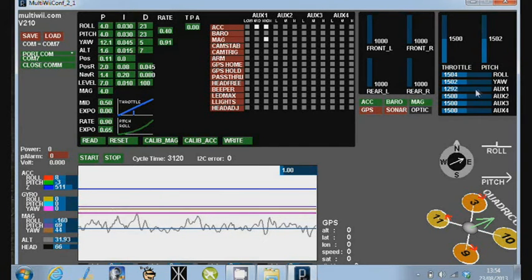I like this display in the top right hand corner because the way it's set up is that the direction of the stick should mirror the direction of the bar. So for example, when I increase the throttle, I should see the bar go up, and when I decrease, the bar goes down. When I push the rudder to the right, I should see it go up, and when I push it to the left, I should see it go down, and vice versa. It's a very easy display to make sure that you set up correctly. I had to reverse 2 of my channels on my Spektrum radio to make it work. So hopefully that makes sense.